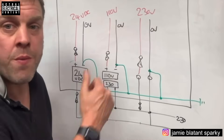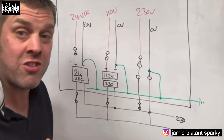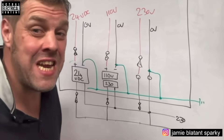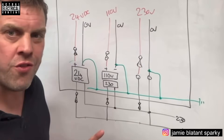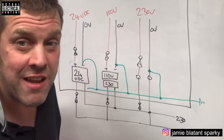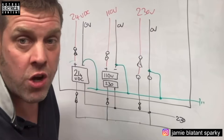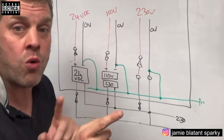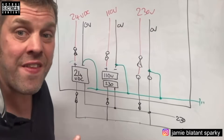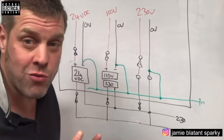Hopefully that starts to make sense - don't expect to get your head around it immediately. You can think of these as batteries: if you've got 48 volts of batteries you can put the negative down to earth so you can test them. You can even earth at the center point, which is a more unusual configuration. Earthing is complicated. If you built a panel and didn't put these earth links in so each supply is isolated, you'd create a panel that's not safe to test - you need to be absolutely aware that the zero volts isn't referenced to earth. On a solar farm, everything is earthed to keep it at the same potential, and sometimes the panels will be isolated DC, sometimes negatively-earthed DC.